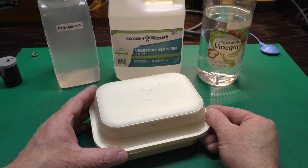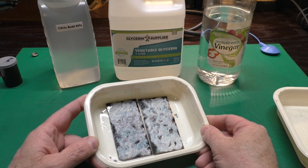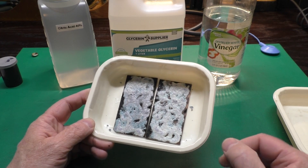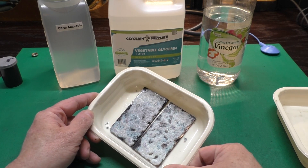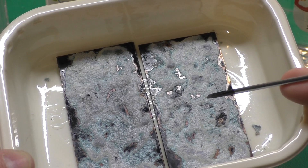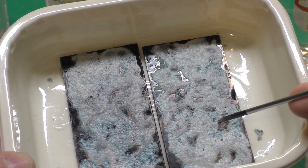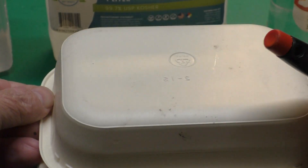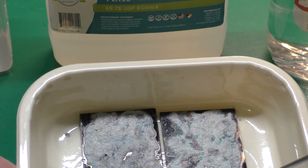In order to run a good comparative test, I cut a few coupons of double-sided PCB material and cleaned the surface with Scotch Brite. I then took apart a dead AA battery and mixed the core — potassium hydroxide and zinc in a paste-type consistency — with some distilled water and spread it over the PCB blank coupons. The PCBs were then placed in a plastic container with a lid and put in a warm place, with water added every few days to keep it moist.